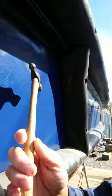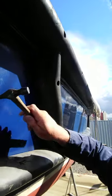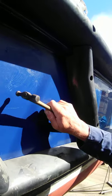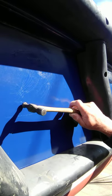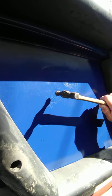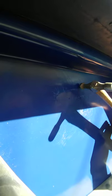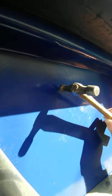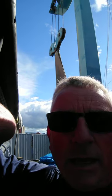It's important where you hold the hammer — I always like a long handle so you get a bit of a rocking motion on it. You'll also get a feel for how it bounces. Very gently coming up, you'll see the difference straight away — there's a little bounce in it as I do it. This is very gentle hammering, nothing particularly forceful.